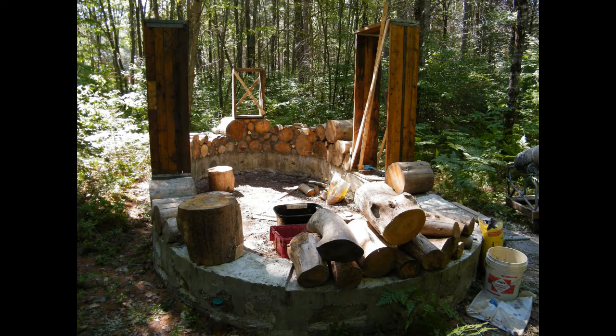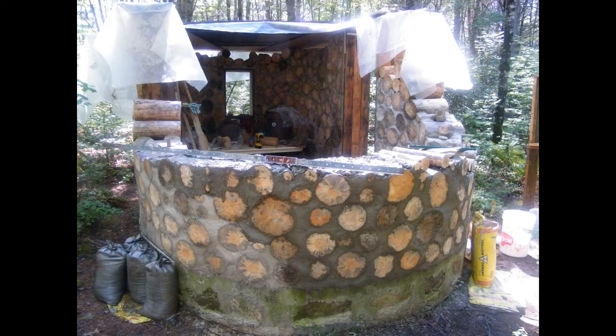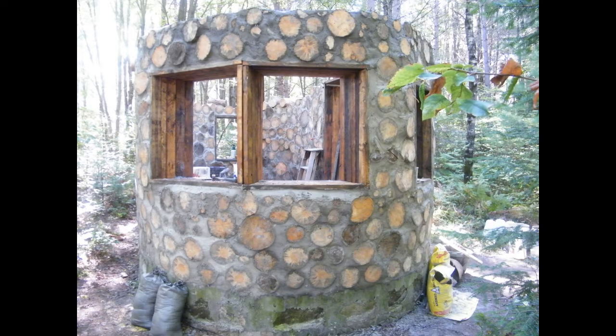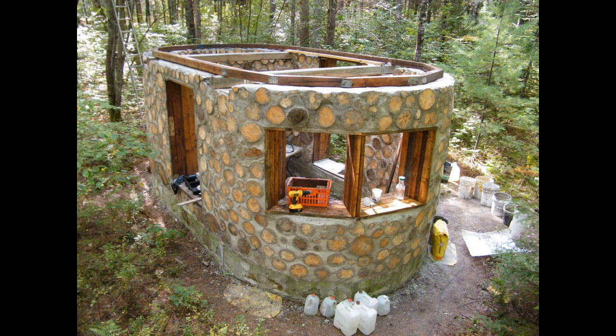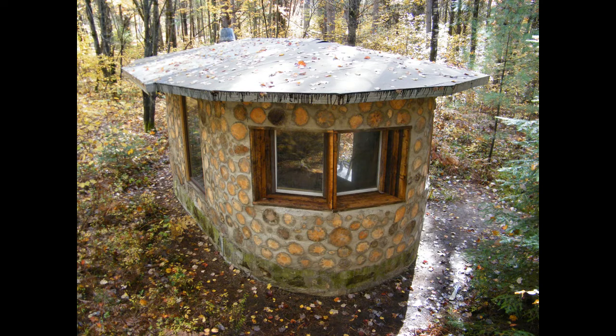At the very end, I cleared the floor, leveled it with sand, laid plastic, and poured a metal-reinforced concrete floor. Along the way, I had to keep the walls dry from rain. I used a water level to get the main beams to within a millimeter of each other, but otherwise mostly just went by eye. I used some custom welding to simplify the carpentry for the roof, and I found that an old table works great as a scaffold.